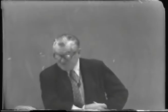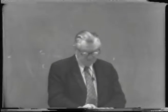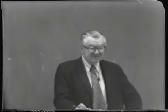In reality, that whiskey doubler is nothing more than one more stage of vaporization. In other words, the first distillate from the continuous beer still may vary from 90 to 130 proof, something of that order. It can be controlled by controlling the amount of reflux run back. So typically, if you had, let's say, a 100 proof distillate going into the doubler, one stage of vaporization would get it up to maybe 140 or 150, and the maximum proof of distillation permitted to be labeled bourbon is 160.